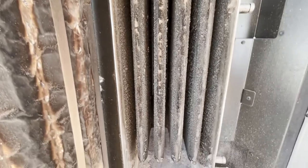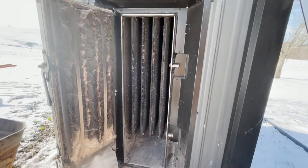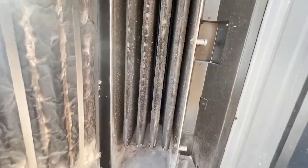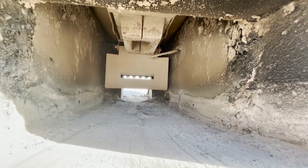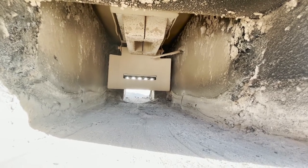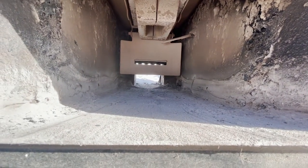You can see here are your heat exchangers - they're vertical heat exchangers - and right there you can see through the front of the furnace. Last time I cleaned this furnace I actually cleaned the heat exchangers pretty decently with a wire brush; they're not that bad right now but I'll still scrape them off a little bit. There's the inside of the reaction chamber, there's a baffle, and you can see the temperature probe on the right-hand side that reads the temperature of the stuff coming in. I'm going to scrape the sides of the furnace and make sure everything's good.